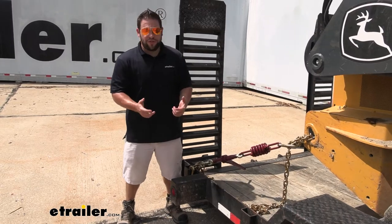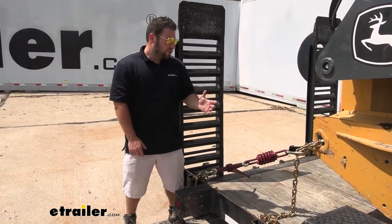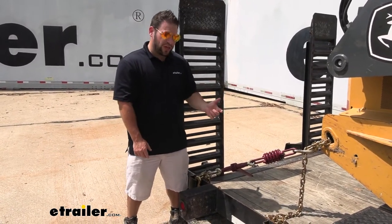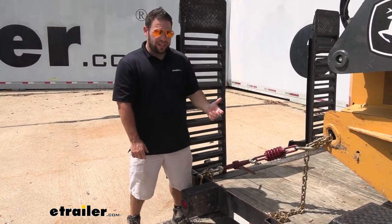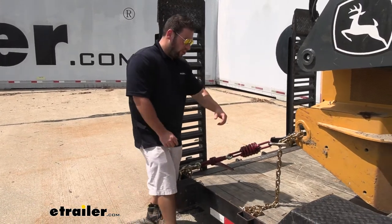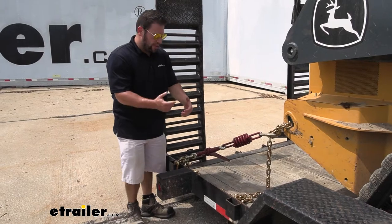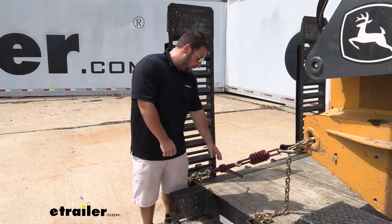Now these are usually used with heavy duty equipment like our skid steer here today — we have it tied down. We wouldn't be able to do that with ratchet straps to get those tight. Clearly this is too heavy for that. When you go to put ratchet straps on there and tie it down, it's just going to break when it needs to have that tension. So you're going to have to use something a little more heavy duty like chains. And if you use chains, you still need to make those chains tight — you can't really just wrap it and pull it tight yourself. That's where the chain binder comes in.